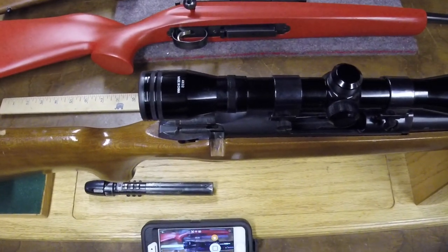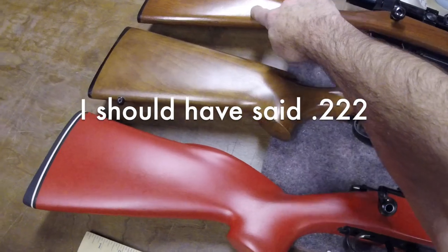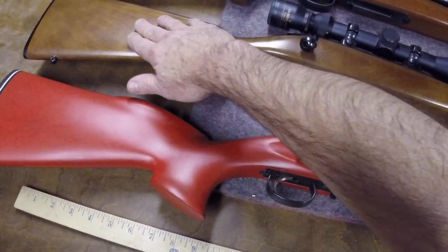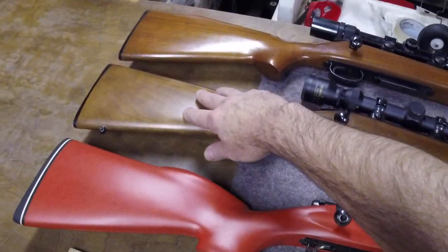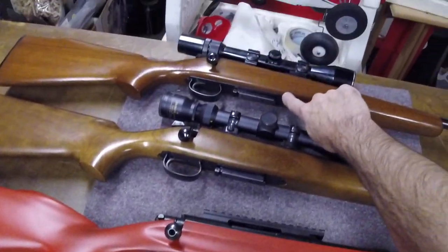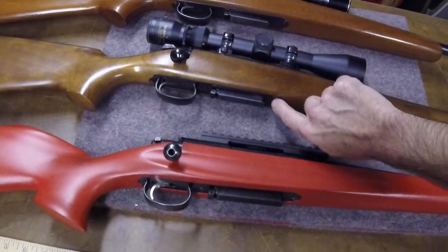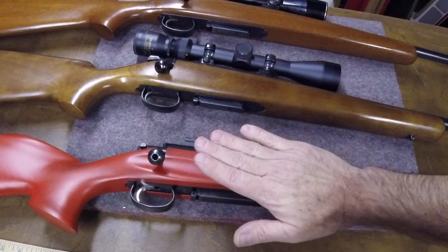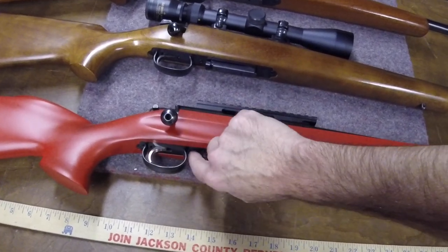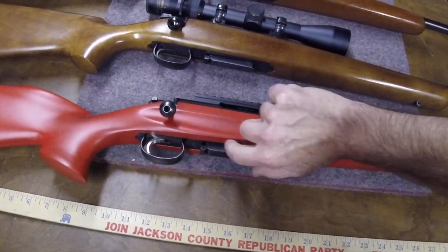Other differences in 788 stocks over time is the wood material. If you look at the 223, this looks like a very straight-grained piece of hardwood — it might be walnut that's real straight. But more typical are these ones that are somewhat birch in appearance, like on this 222. You can also see two variants here: on some, the steel floor plate is simply surface-screwed to the bottom of the stock, and on others they're inletted. When I did the work on the red rifle stock, I inletted the plate myself because with the Timney trigger the clearance was a little better. This stock is a little bit deeper in this dimension than a standard stock, so I went ahead and inletted that myself.